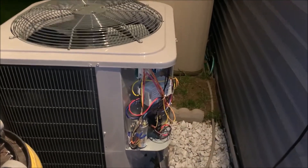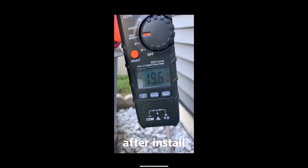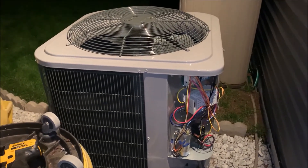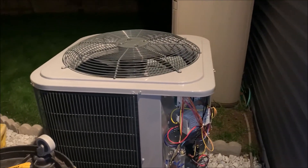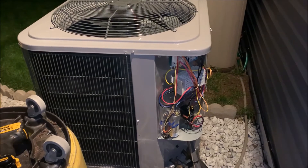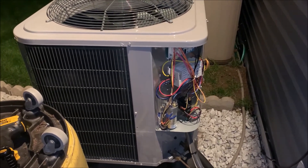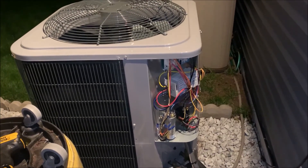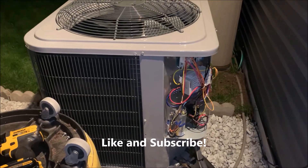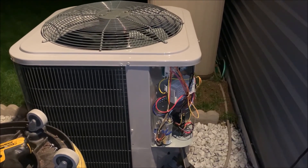This was kicking on at about 68 or 69 amps, which knocked the generator down enough to make the lights flicker — you could hear it miss and spin back up. That's completely gone; you cannot even tell when this heat pump kicks on at this point. I do have battery backups in the house on the TV, and if there's any drop in voltage they were actually kicking on because the amount of power it would pull from the rest of the house would make them go into safe mode. They don't do that now — and those battery backups are set for computer specs, the highest you can set them, and they don't kick on at this point.